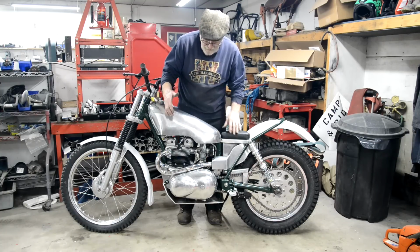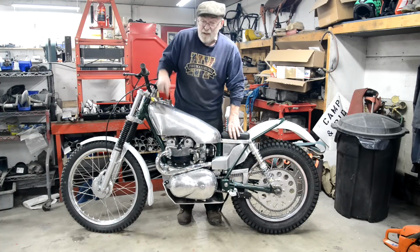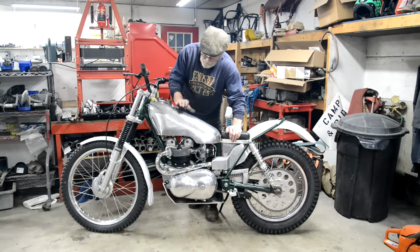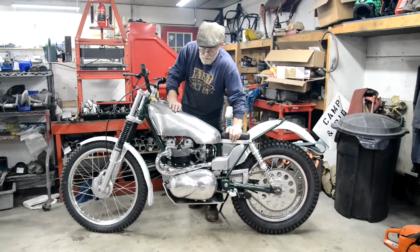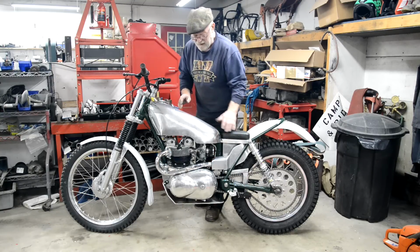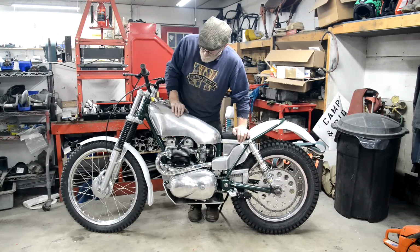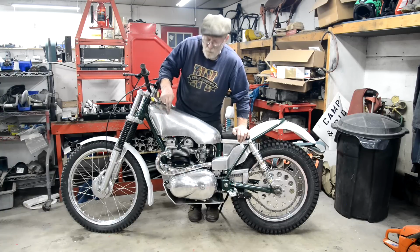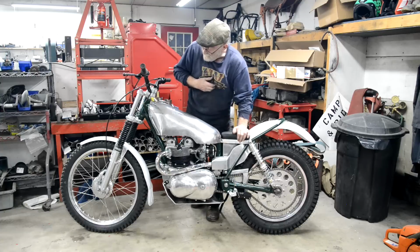What else? So really, you have to take more trouble with the design. You have to make sure the buck and the form are absolutely spot on, because I think particularly the buck wasn't quite right. So it didn't come out perfectly symmetrical, both sides. But on the whole, 3003 is the type to use, and 4043 for the welding rods, because as you can see, the welds have disappeared. That matched up perfectly.